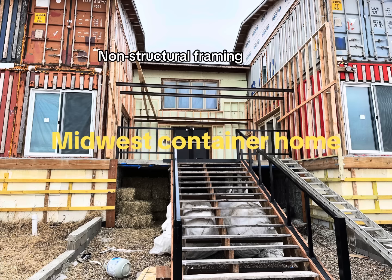I've already done the framing on the basement walls, which is that white part that you see at the bottom. The reason it is white is because that's insulation, so it's already been insulated. The basement is reinforced poured concrete, and it was poured in what's called ICF, insulated concrete form. So on the day the basement was poured, it was already insulated inside and out, so I don't need any additional insulation for my basement to be livable.